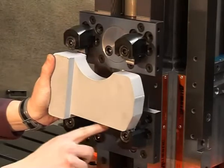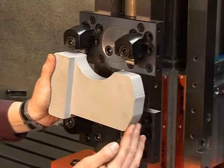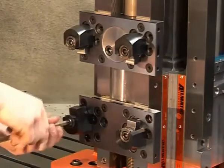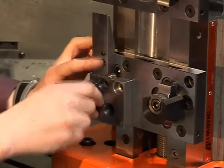However, as shown in the following example, adjustments need to be made for workpieces with a relief on the side in contact with the fixed jaw. In this case, workpieces require Cartesian alignment with the fixed jaw's clamping points.